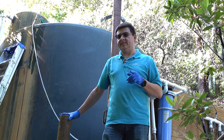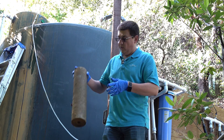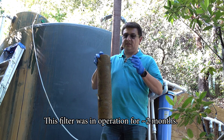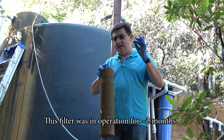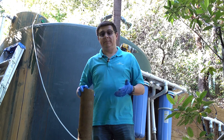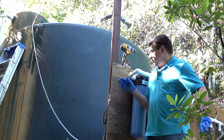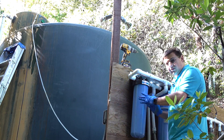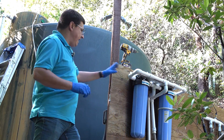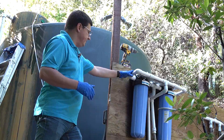There's one last step: we have to remove everything that's been oxidized out of the water. We do that mechanically with these filters. These are dual-gradient filters — 20 microns on the outside grading down to 5 microns on the inside. That gives you the best filtration and won't plug as quickly as a straight 5-micron filter. We have a dual filter setup running in parallel rather than series. You could put a finer filter after these if you wanted to, but for us this setup has been working just fine.